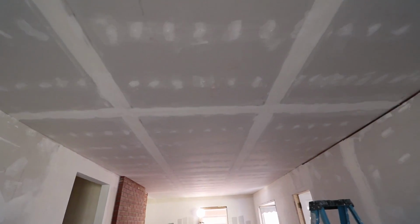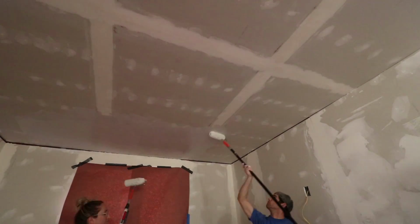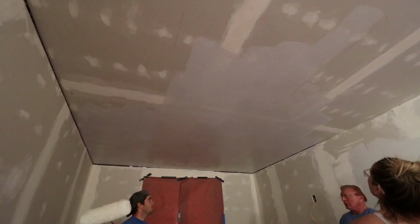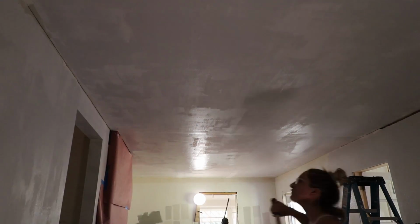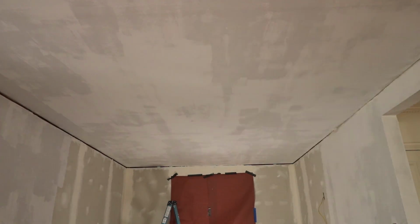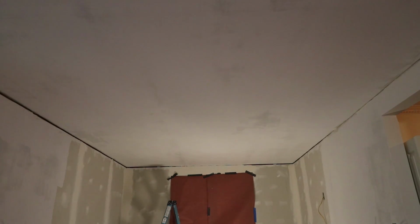After several days of laboring on the ceiling, it was finally time to paint. We started with a thick primer to coat the new drywall. We also took this time to prime the walls for a new color. We were a little bit confused at the splotchiness of the primer, but soon realized that areas where we laid it on a bit heavy just took a little bit longer to dry. It all dries the same color to give a clean and uniform surface to paint.